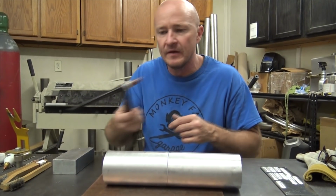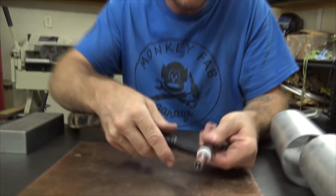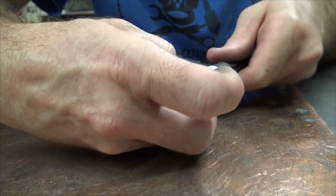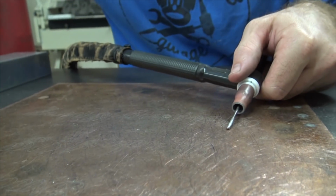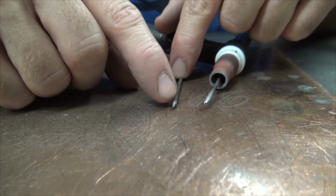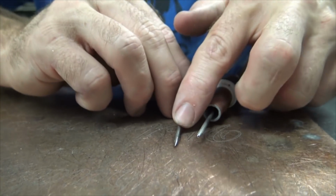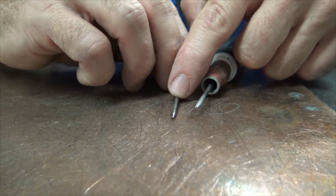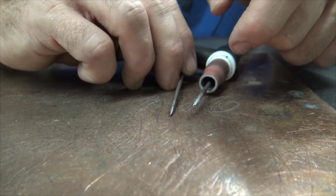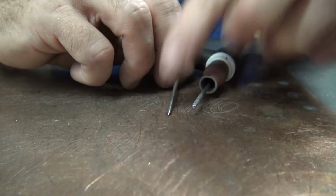So it's going to be a number 5 cup. People ask me how I do my tungstens for aluminum, and I'll show you exactly how I do it, if I can get this guy to let go. Generally when I screw them up, I'll take them to the belt sander or my tungsten grinder and grind them down to a 45, then I'll knock the tip off. The very little pointy tip, I knock that off. I think it's called a truncated cone, I believe. That's how I do it if I dip it in the tungsten and I need to start from zero.